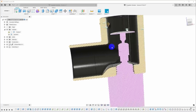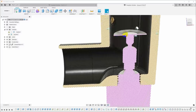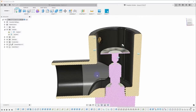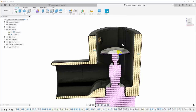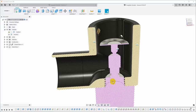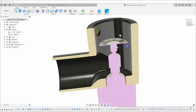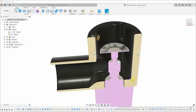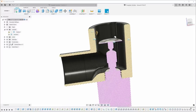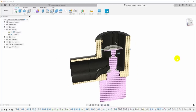And you can see I've got all the surfaces rounded and smoothed on the inside so that there should be continuous airflow down through the top and out, so that any of the dust that comes off or any of the grinding grit, which is going to be diamond and tungsten and maybe some metal, isn't going to end up in the bearing of the rotary tool or in the air where you breathe it. It's instead going to get pulled into the vacuum. And in fact, if you cut the tip off of a tungsten, that should get sucked into the vacuum as well so that it won't get bound up or caught in the bearings or in the nose of this tool.